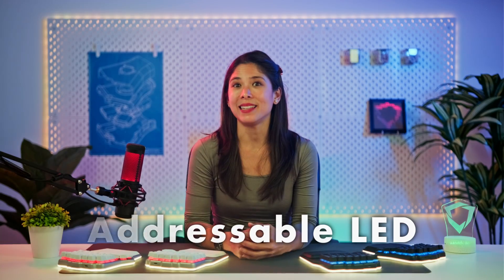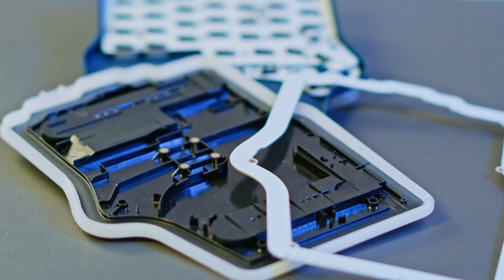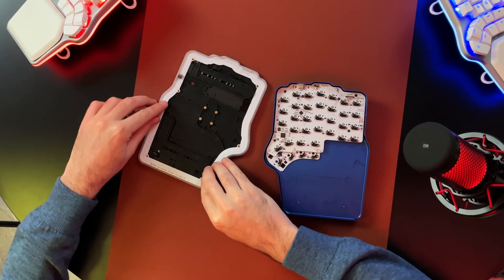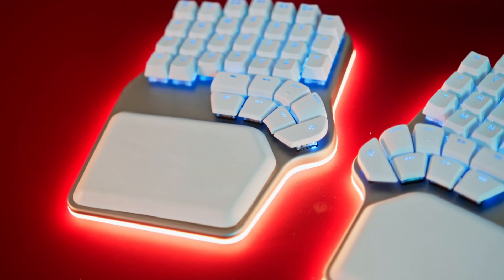The solution? Addressable LEDs. Each addressable LED, also called ARGB or smart light, has a microcontroller of its own which removes the need for an LED driver. They are much more expensive, but we decided to absorb the cost. Removing the LED drivers helped solve the fitting issue. We could now place an ARGBW strip around the perimeter, making it much easier to have an evenly lit underglow. Being just 16mm wide, the strip leaves enough space for the tenting legs and all the other elements that need to go into the base — like the wireless neuron, the RF PCBs, and the batteries. However, we still need to fine-tune the light distribution, moving the LEDs slightly to avoid dark spots or burn spots on the diffuser.